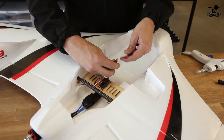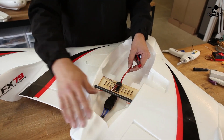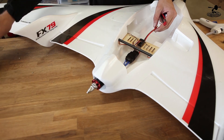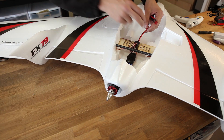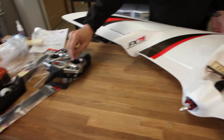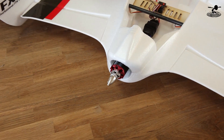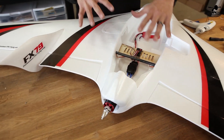I'm going to plug in a small battery and power on the transmitter, then calibrate the ESC. I do not have the prop on — you do not want the prop on yet. Move throttle all the way to full position, make the connection, listen for two beeps, reduce throttle all the way down, then three beeps, and a final beep means it's been accepted. Your ESC is now calibrated and your transmitter is giving it the proper full range of throws. If you ever plug in a model and you're not getting full performance at low throttle, make sure you calibrate your ESC.